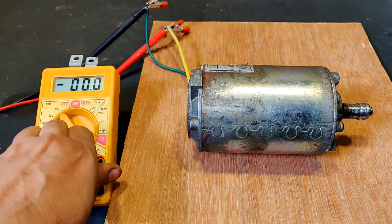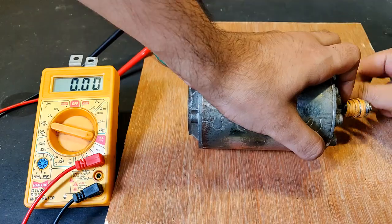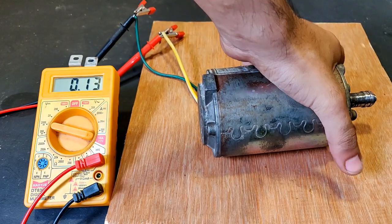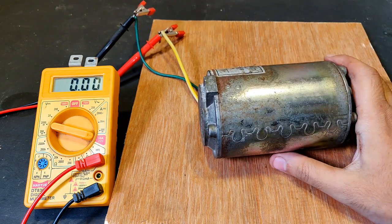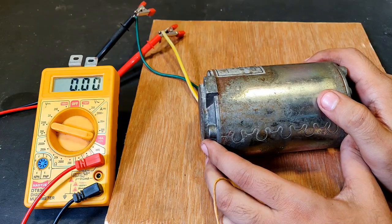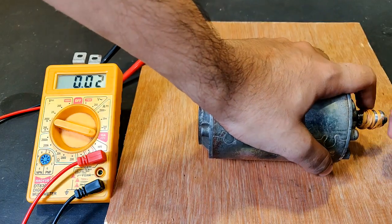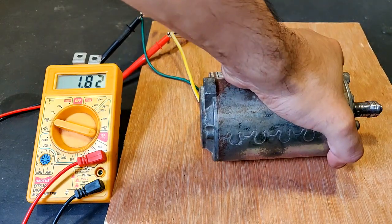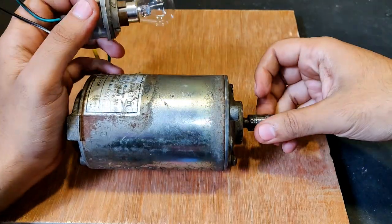Let's measure the current now. Keep watching the display screen — 5.69 Amperes. The motor is very powerful, generating around 5.69, I'll take it as 6 Amperes. So 6 Amperes at 30V equals 180 Watts. Trying once more a little harder — I generated 6.10 Amps with rope rotation. That was really high current.